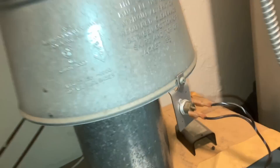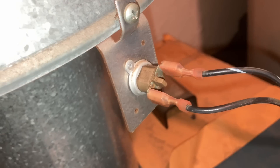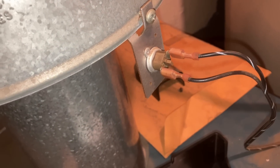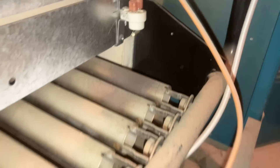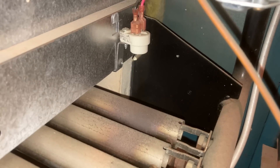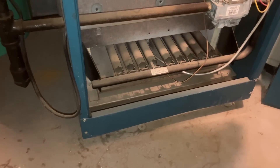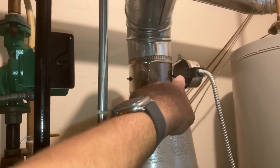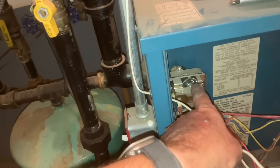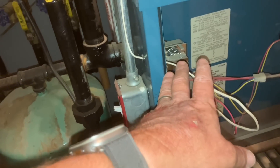This little doodad right there - if you have no heat - is a resettable sensor. That's a BVS or blocked vent switch, also known as a spill switch. If exhaust gases are spilling out of the bottom of the draft diverter, it senses the temperature of the hot exhaust gases and pops. You can reset it by pushing it in, but not over and over. Down here there's a rollout switch - that's a ceramic fusible link. When it senses a certain temperature it burns out and needs to be replaced after the issue is resolved. You actually have several safeties: one built into the vent damper, the spill switch, the low water cutoff, the rollout switch, and the high limit.